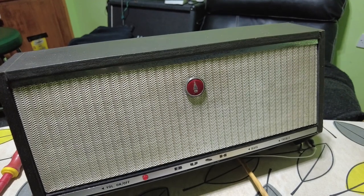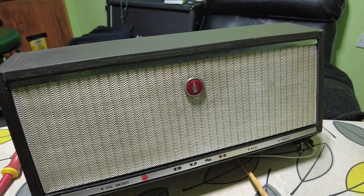Let's try something with humbuckers. It is beginning to overdrive now with the humbuckers pushing it. There'll be a lot of things wrong with this amplifier — the bypass capacitors will probably be leaking on the cathodes, the preamp stages may or may not have a cathode bypass capacitor on the output stages, and that could be leaking as well. All these little things mean we're losing gain.